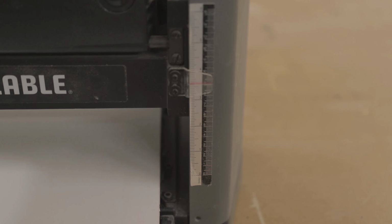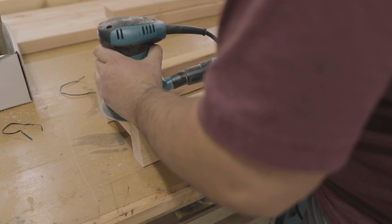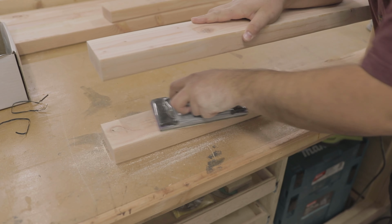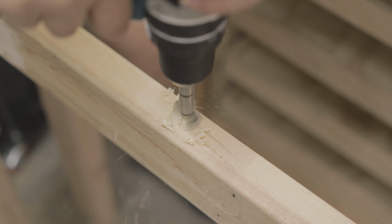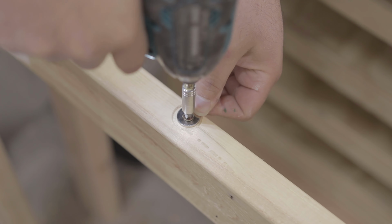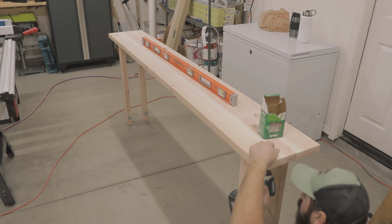After running the board through the planer, I used my belt sander to remove all of the snipe from the board. Then I sanded up to 220 grit using my orbital sander and some hand sanding. I attached the stretcher between the legs. Then I drilled recessed pockets for my figure 8 fasteners, which are also linked in the description, to sit in using a Forstner bit. Then I laid out the top on the base and fastened everything together.